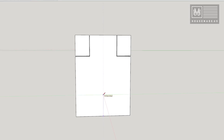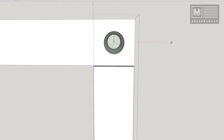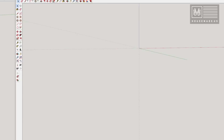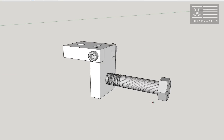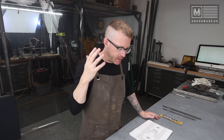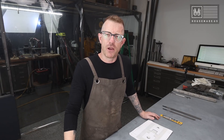Really all you have to do is cut these pieces of steel out and drill a hole straight through them. You've got to tap the threaded hole for the half-inch bolt that holds the wheel and drill a hole in the top so it can mount to the tensioning bar, but other than that it's a fairly simple process. You can go out and buy a one-and-a-half inch by half-inch piece of flat stock or bar and create this with almost four cuts. The bolt is shorter, there are fewer cuts involved, and if you have a CNC plasma you can make it as pretty or as simple as you want.